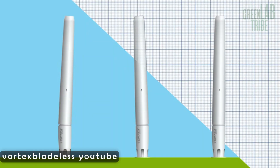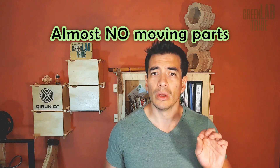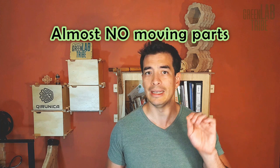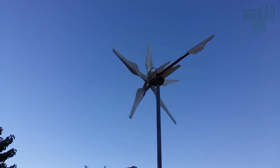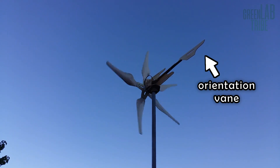When this force frequency matches the natural resonance frequency of the pole, the pole oscillates. Vortex Bladeless created a design that uses this vibration to harvest wind energy. I think this is a really clever idea because just by seeing it, the two main advantages jump to the eye. First, almost no moving parts — the only part that moves a bit is the pole and it's just a vibration. This can result in less cost of production and maintenance. And second, there is no need for an orientation system. Regular wind turbines need an orientation system because they have to face the wind in order to work. But with a bladeless turbine, wind can come from any direction and it will still work.